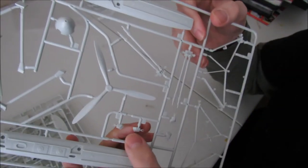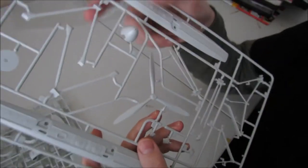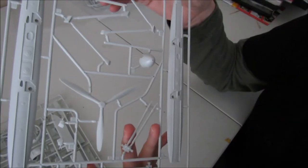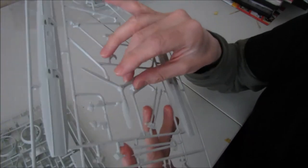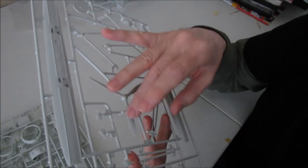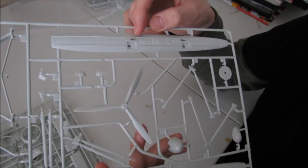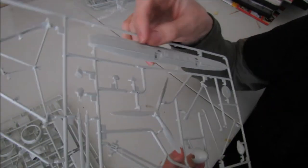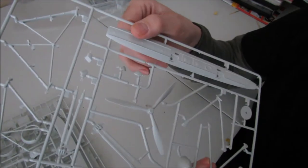Very, very clean, and all these small parts. And the propeller edges. You've got compound surfaces that you have to shut off from one to the other, and you'd expect a little bit of flash in some areas around that propeller, because that's all compound surfaces shutting off on each other. But there is literally zero flash around the edges of that propeller. That is excellent engineering.